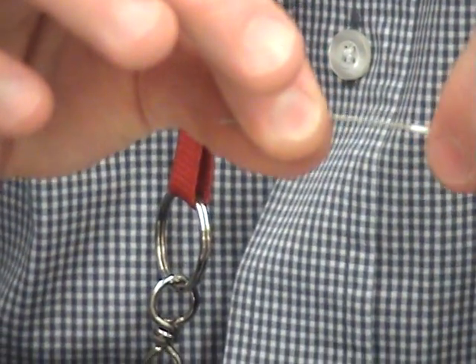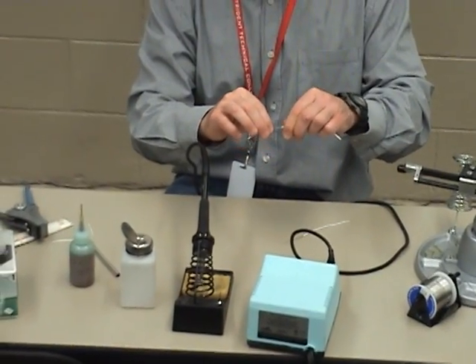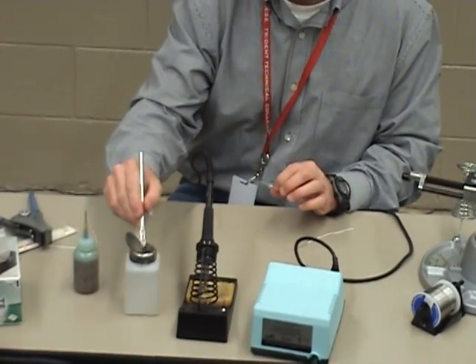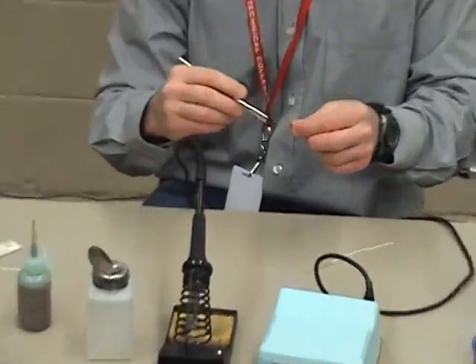I'm just going to roll my fingers over here lightly. Remember, when I'm doing this, I'm getting ready to solder — I'm introducing oils off my finger. That needs to be cleaned off. I'm going to do this one too, just roll it. The strands are all nice. I'm going to go ahead and do the old clean with alcohol and tin her up.